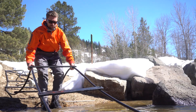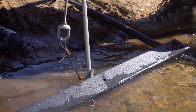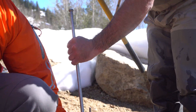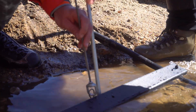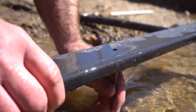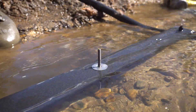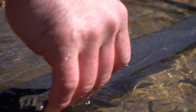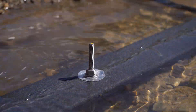During the installation process, it's important to keep tension on the cord. Starting on the opposite bank, drive the first duckbill anchor as deep as possible using the provided drive steel until only a few inches of all-thread remain above the rung. Put the all-thread through the rung and install the large flat washer, small flat washer, lock washer, and quarter-inch nut, tightening with a 7/16th wrench. Repeat with each rung and cut off any excess all-thread.